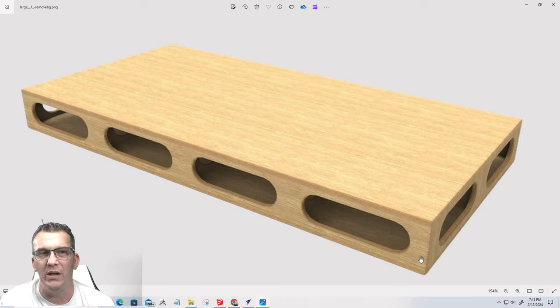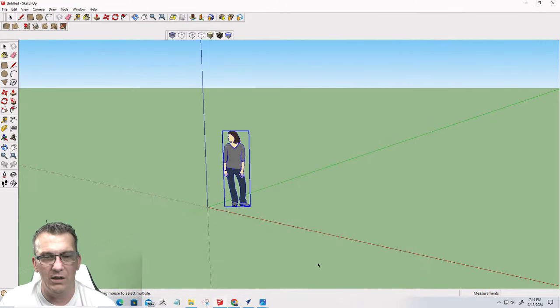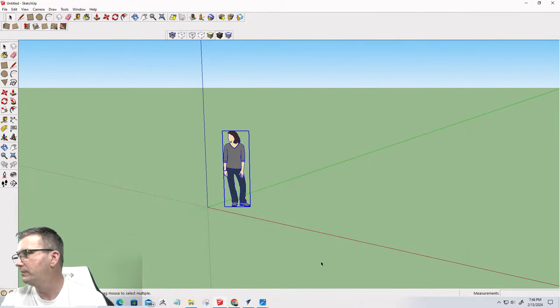I honestly think I'm going with a 3/4 inch cabinet grade plywood for the framing and all. And I'll do some edge banding and everything to make it look really good. I don't think hardwood would be a good choice for me because of the wood movement, and I'm in Florida, humidity and all that stuff. So we're going to go with a plywood build and we'll go from there. So let's start. We're going to start our class tonight in SketchUp.